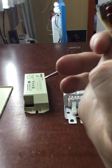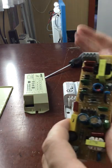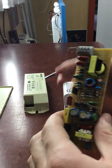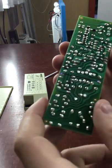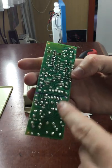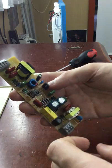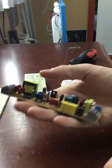That's technically all there is inside the electronic ballast — it's all there is regulating the power flow and converting it to power your tube. So you need a special LED tube to operate on this electronic ballast, whereas any LED tube can be operated on the magnetic one. On the back you can see everything connecting and going out to the tubes, all soldered on just like the motherboard in your computer.